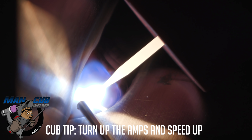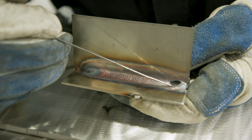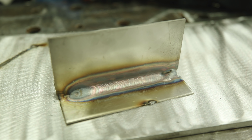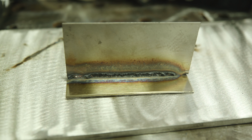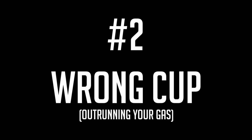We see this a lot of times when people dab too slow. You guys see this right here? That's bad, it's going too slow. That's very bad, guys. You're moving too slow, all right? Don't move slow or you're gonna look like this, sugar. This is bad, your friends are gonna make fun of you, your fellow welders. Don't do that, go fast. Don't go slow like that and don't dab slow, all right? Keep practicing over and over, just move fast.